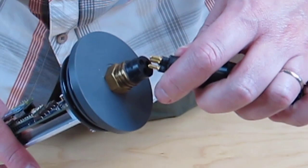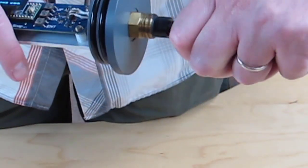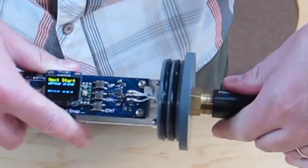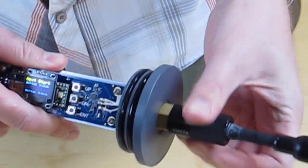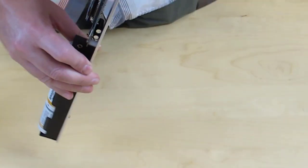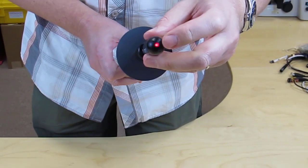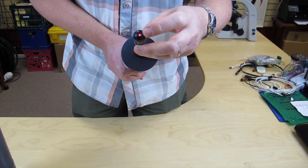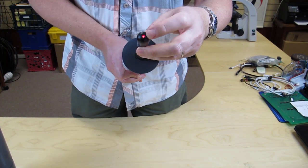We're going to line up the key pin and just push it straight on, then screw down the retainer — that doesn't have to be very tight. If you look at the end of the hydrophone, you'll notice there's an LED indicating that the hydrophone is getting power. When the Snap goes to sleep, this LED will turn off.